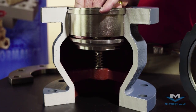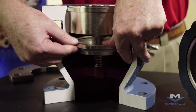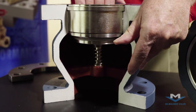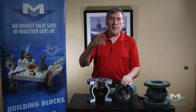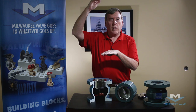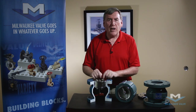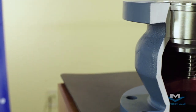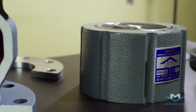From full open to full close is a very short stroke and it closes very fast. Let's assume the pump is in the basement of the building and you're pumping water up 10 or 20 stories. As the pump shuts down, and just before this 20-story column of water had the chance to start to reverse and go backwards, this valve has closed. With the valve closed — no slamming, no water hammer, no destructive or annoying banging.